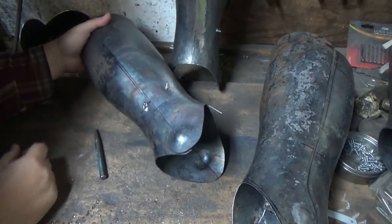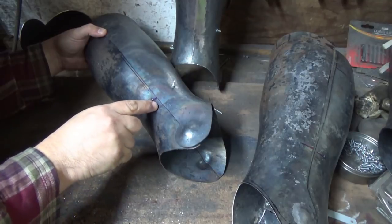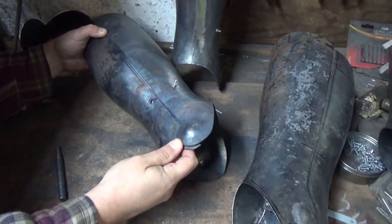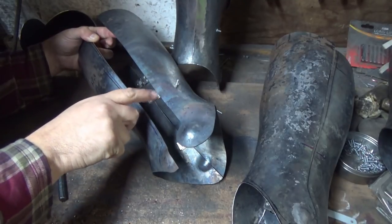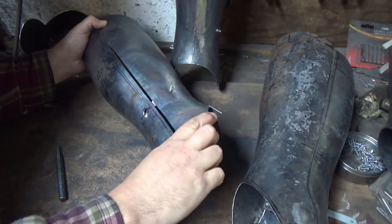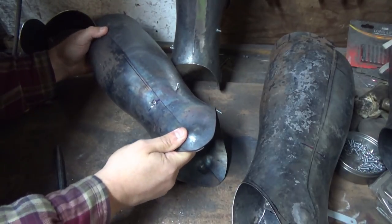Straps and buckles can stretch over time, they can get knocked off and smashed and broken quite easily. This was a technology developed relatively early on, so it ran side by side and eventually pretty much replaced straps and buckles in most cases. All you do is give it a press, take it past the hole, and it springs open. That's a little bit of sprung steel attached to the front, ground off at the back, so when you go back and get things lined up, just get it past the greave's edge and there you go — locked, won't stretch or open.